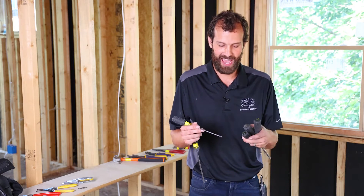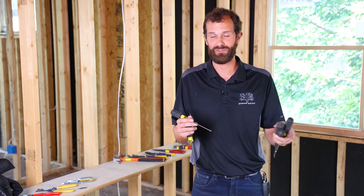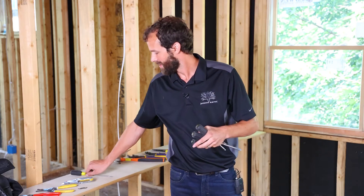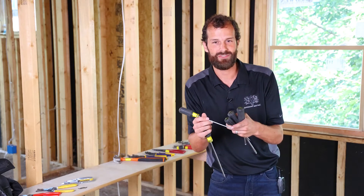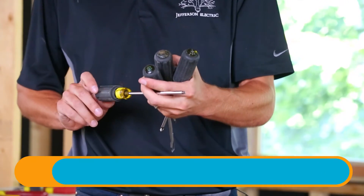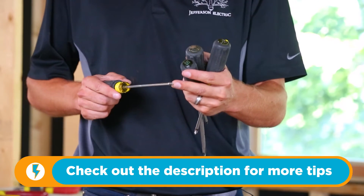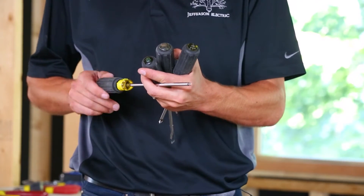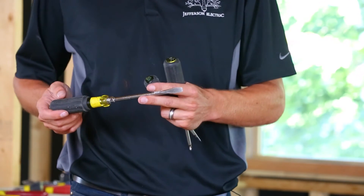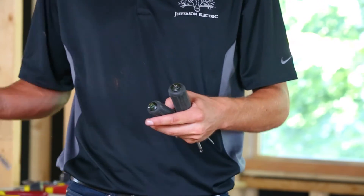If Adam and Eve had never sat in the Garden of Eden, we would have skipped the flathead entirely and gone straight to the T25 Torx. But a 3/16 flathead is good for your plate screws and a lot of other things. This is a number two square drive — good for panel terminations. The industry has migrated to more number two tooling because it's consistent and difficult to strip, and you can get a lot of torque on it. The 5/16 flathead — this is your chisel, your pry bar. It's not intended for that use, but it works really well in a pinch.